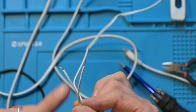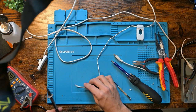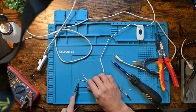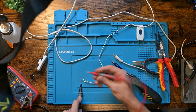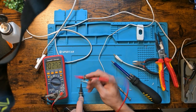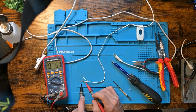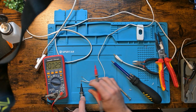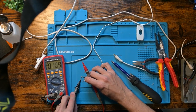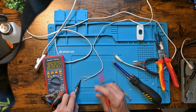So we've now got a full white cable and we've got a dashed cable. The cable is plugged in so there is 12 volts coming out of this. I'm going to put one end of my probe on one end and the other end on the other. This gives me 12 volts, a little bit over 12 volts. I have the red probe on the cable with the dashes, so now I know for sure that this is positive and this is ground. If I had my prongs the other way around, I would have had a negative voltage — that's how you know which one's positive.